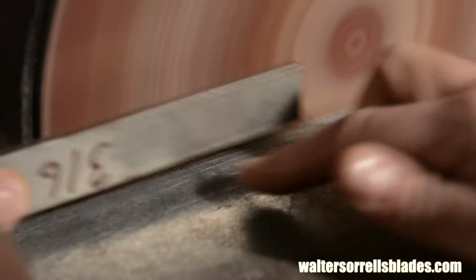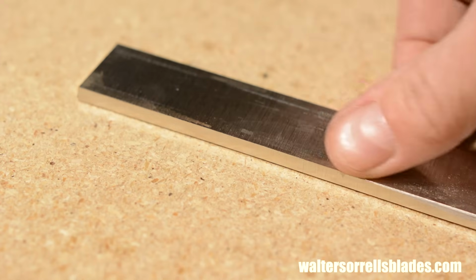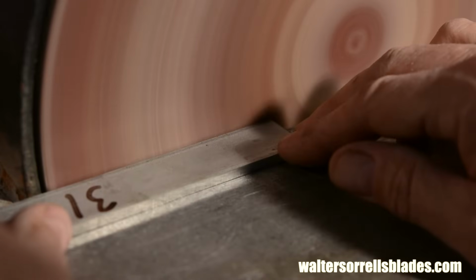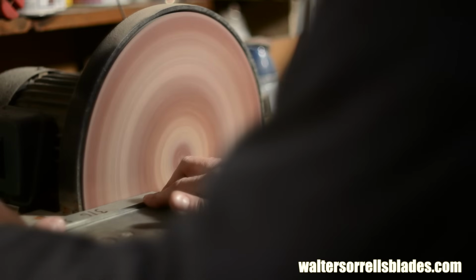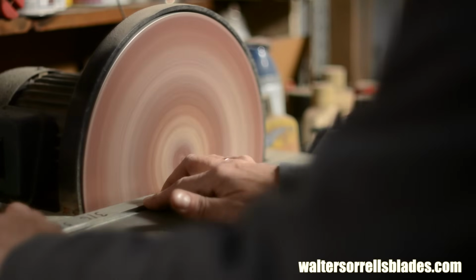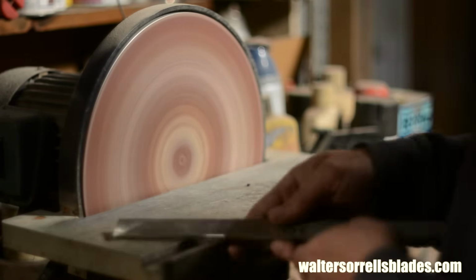This takes a little practice. Disc grinders also love throwing things around your shop, and you just have to get a feel for where your grinder's sweet spot is. Once I've established the flat bottoms of the pieces, I'll grind 90 degree angles on the sides. It's worth using a machinist square to check that your table hasn't shifted. If the table is set at, say, 88 degrees, which you probably wouldn't be able to perceive by eye, it wouldn't matter how careful you are, you'd end up with an ugly gap between the wood and the bolster on the handle.